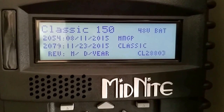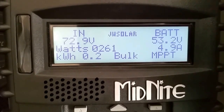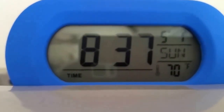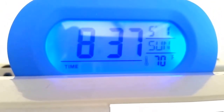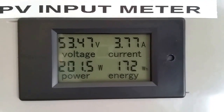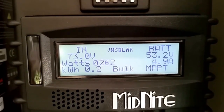We jumped up a little bit and got to 265 watts coming from the array at 4.9 amps — that's 53.2 volts from the battery. We've made 0.2 kilowatt generated within this hour; the sun just came out. You can see the MPPT is working: 3.77 amps, 5 amps to the battery. See that MPPT working — 203 from the solar array, 272 watts on the Classic.